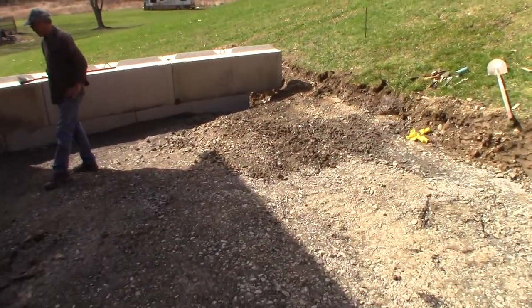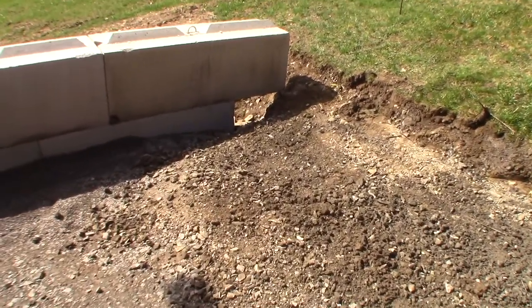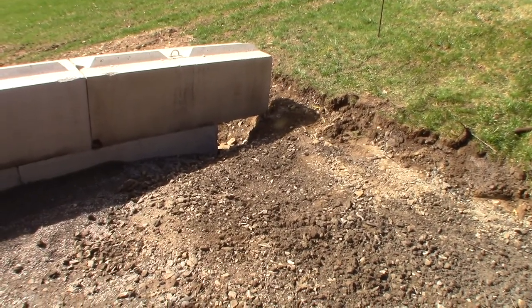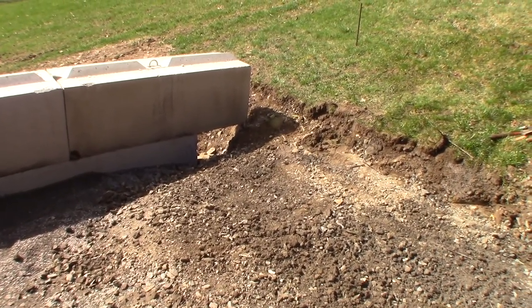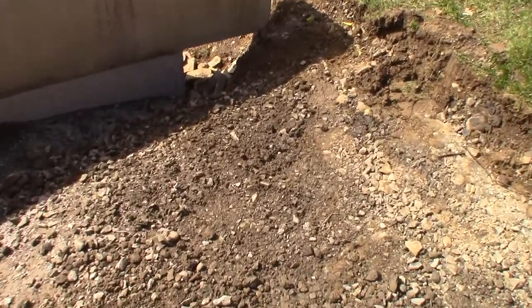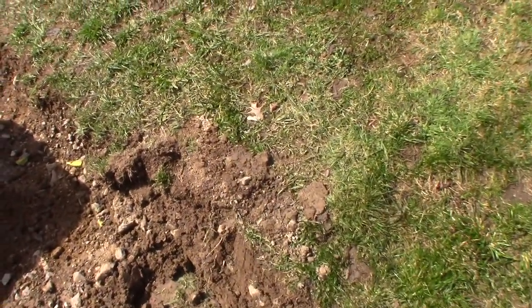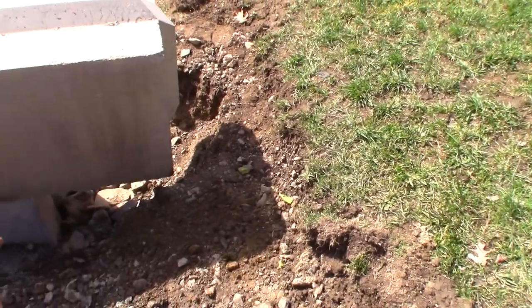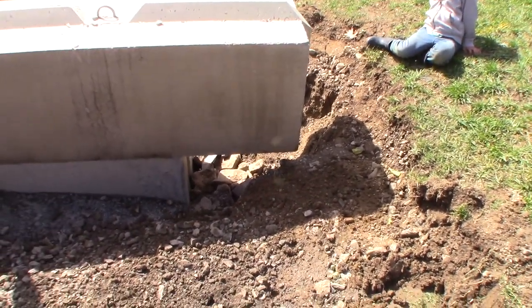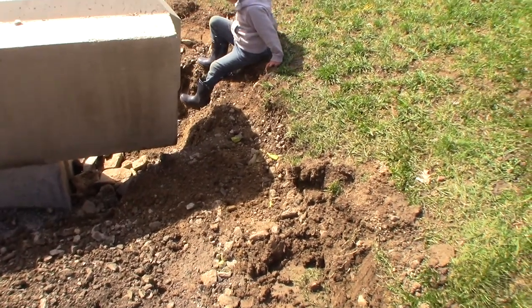And what are we doing in this corner over here? I think we're going to keep pea gravel tight to this. Are we doing pea gravel in that corner? Yep. So it'll run out? Yeah. The whole concept is that the water gets out of it. It never sits. Or, hear me out for just a second. Should this be modified? Just pack that one modified and figure we get rid of the water up here before it even gets down there. No, because it'll always get down there. I want it to go away, don't you think? I think modified there, pea gravel up here.